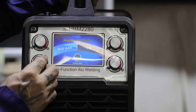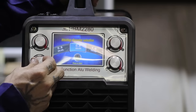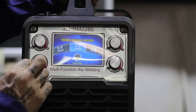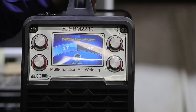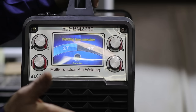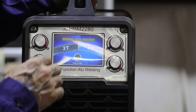You can pick the different type of gas — if you're using a mixed gas or if you're doing straight CO2. Then your different wire diameters. I think that's 035. And then 2T and 4T — this is for when you're hitting your MIG gun trigger. 2T means you push the trigger in and hold it until you're done welding; when you let go, it stops. 4T is four touches — you hit it and release, and it welds until you hit it and release again. Basically 4T is for long duration welds so your finger doesn't get tired.